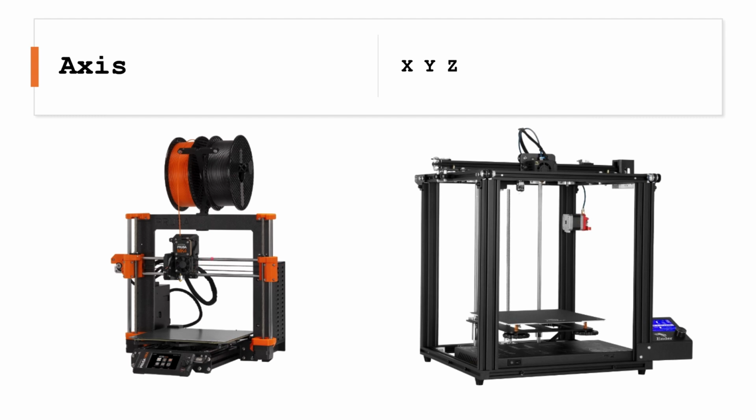but that's the simple basic of how G-code looks. So, let me just write it down. Let's just say it's G and then X1, Y2, and then Z3. So what this will do is 1, 2, and 3 represent a position on the axis. So on the x-axis, there's position 0, which is where the end stop is. Here, this is the end stop.